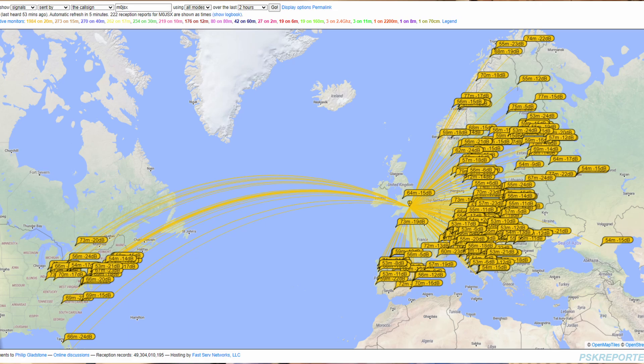Moving over to the 20 meter band — I may have been running this for closer to 30 or 45 minutes. We can see one nice hop into central and southern Europe, and into eastern Europe as well; there might even be two hops into the Moscow area. Moving west, we're getting at least two hops into the east coast, and a bit further west into Indiana and Michigan too. So the antenna is definitely working on both bands, and being vertically polarized means the main lobe angle should be a little lower than a horizontal antenna.